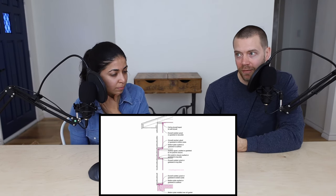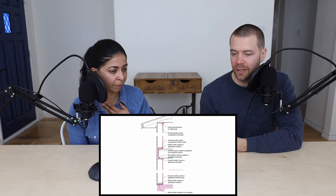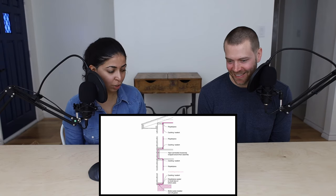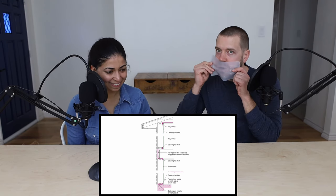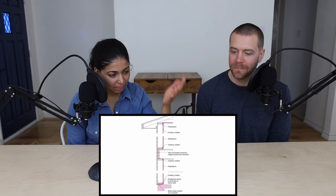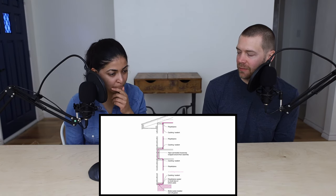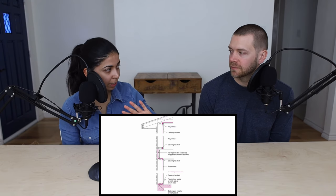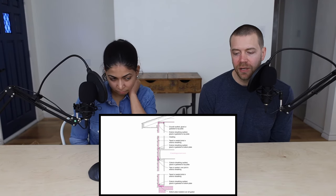The first method is using drywall and framing — the majority of homes use this. Drywall is an air barrier, and you have to tape and mud your joints just like you would for a smooth surface, then close all the holes and penetrations. The second diagram shows achieving an air barrier using just thin polyethylene sheet — not high-density polyethylene like Tyvek, just a thin sheet of plastic. This has to be wrapped underneath the bottom plate, which needs to be considered at the beginning of your framing.